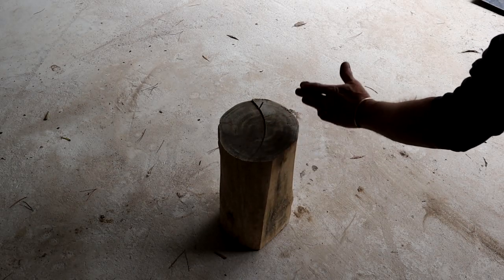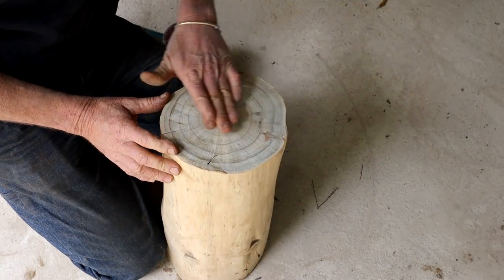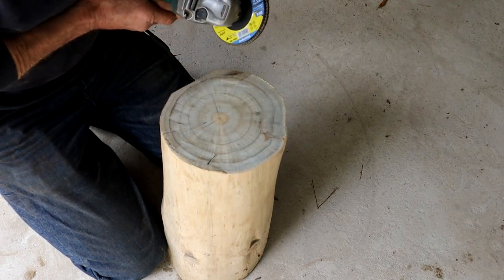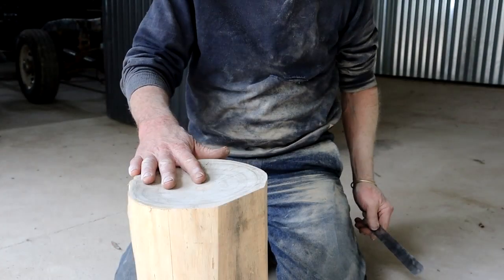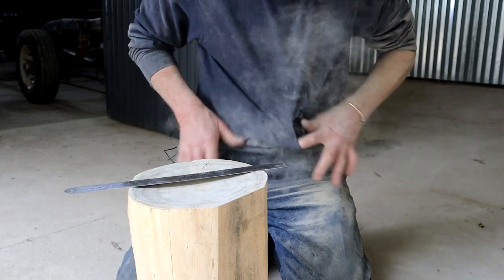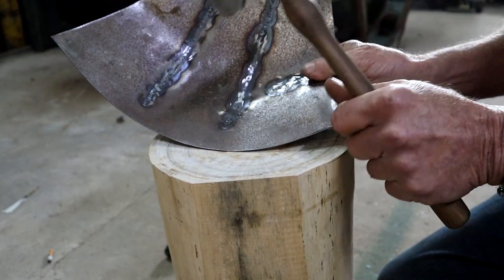I think I will actually do a little bit of that. I found this log - so I'm going to try and make myself a forming tool, if you want to call it that. It's only pine so it's softwood, but I want to use this and see how it goes. The idea is to hollow this out. I'm just trying to create this hollow using a flap disc on my grinder. Making progress, yes, but I do think it needs to be quite a bit more. I've never done this before so I have no idea if this is enough - we'll just have to go and find out. I am covered in dust but I was clever, I came and did it outside. So I'm going to use my homemade hammer and my homemade stump and stretch some metal.